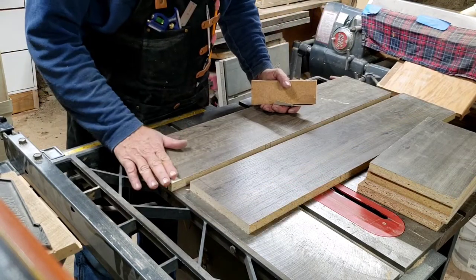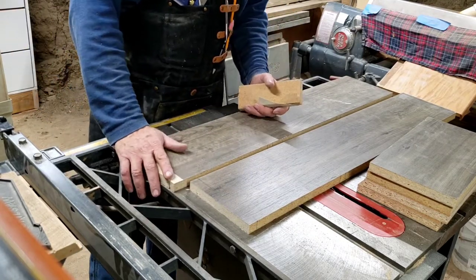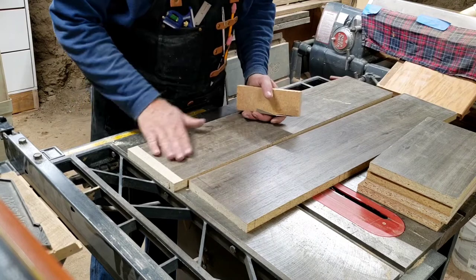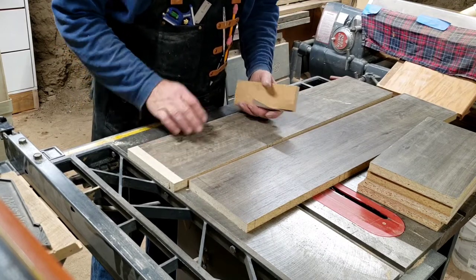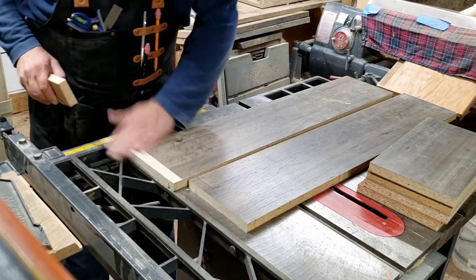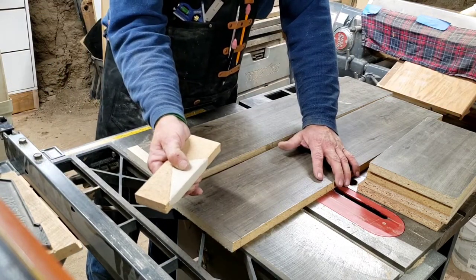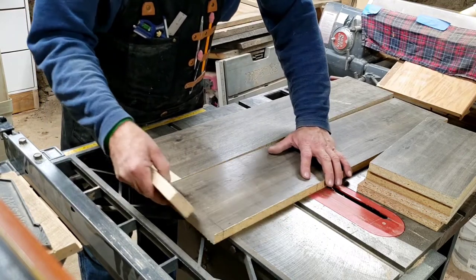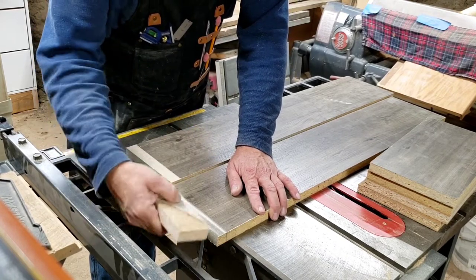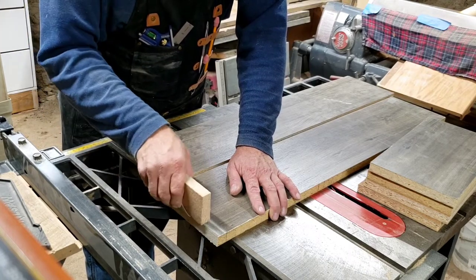An alternative would be using dados, but remind you this is not a kitchen cabinet — this is a storage cabinet for a workshop. I am not going to put dados in here. This shelving material has a kind of wallpapery finish, so what I've already done is prep one edge to get right down to a nice MDF surface. I'm just taking a scrap block of three-quarter, using my fingers as a guide on the edge of the board with some 80 grit — it's only about 30 seconds, maybe not even that — a few swipes and I'm already down to the MDF material.